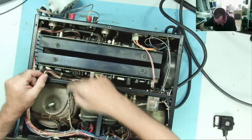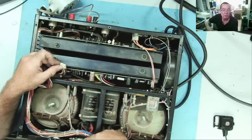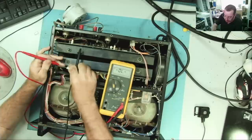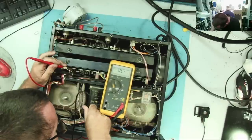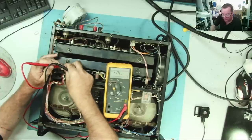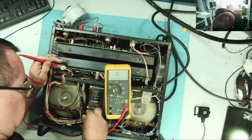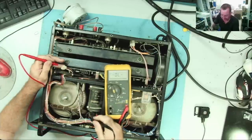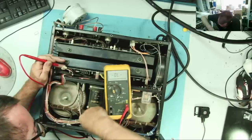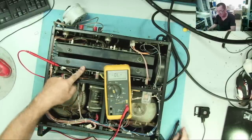I think to be double sure, if we disconnect this we can just get the meter and see if it connects to there. The brown wire is the top one here — let's go for continuity. Does brown here go to brown on that one? Yeah it does. Let's try the red which looks like it's the second one down. Yeah, red to red — so this is the amplifier module that's giving the error.